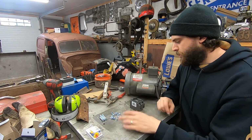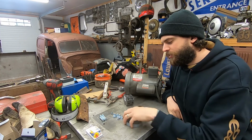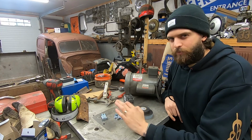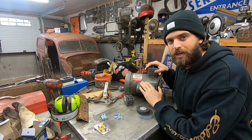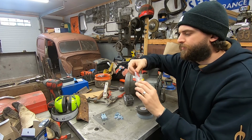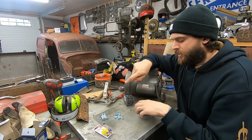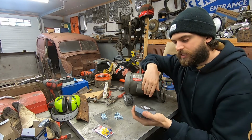Also at Lowe's, got some supplies to wire it. So I got a 2-pole, 20 amp breaker. Got some 5/16-18 nuts, 5/16-18 fully threaded screws, because I didn't have any, I had partially threaded and I need full thread for what I'm trying to do. Also got some connectors. When this gets wired to high voltage, there's 3 wires that you just kind of connect to themselves, and I didn't want to just tie them with a wire tie. So a buddy of mine who's an electrician told me to get these connectors, crimp them onto the wire, put a nut and bolt through them, put rubber tape, then electrical tape, and you'll be all set. So following his lead, he apparently knows what he's doing.